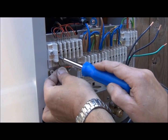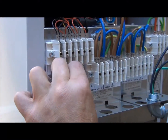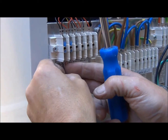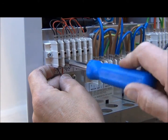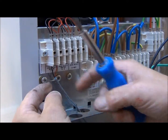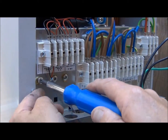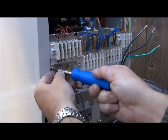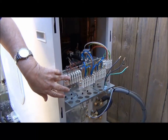The color coding is very important. The black wire here is connected to the black terminal, or C1, at the indoor unit. We have to connect C1 to C1 on the indoor unit, C2 to C2 the same way. And we have to ground the drain wire to the chassis. So that's something a little different with the I-Series — the communication lines.